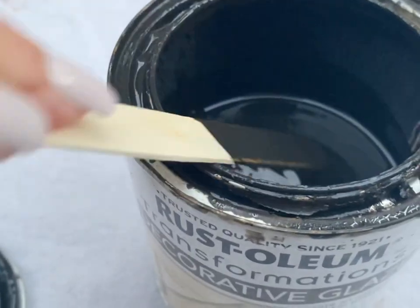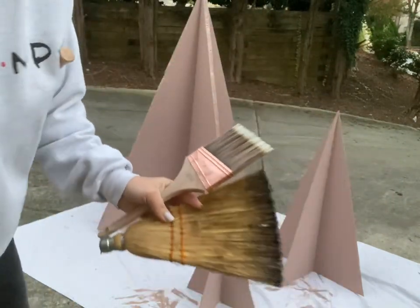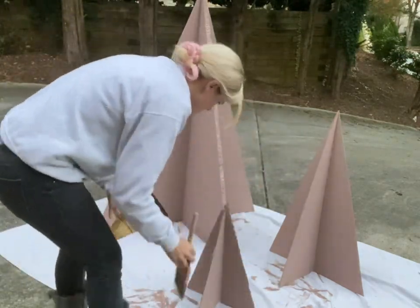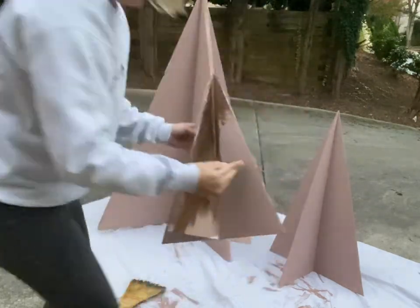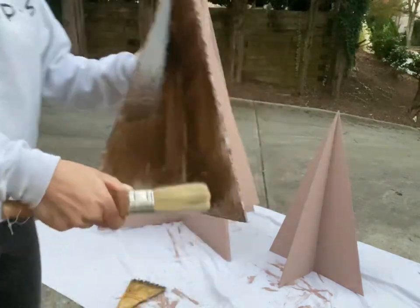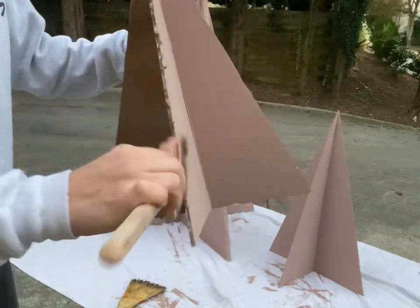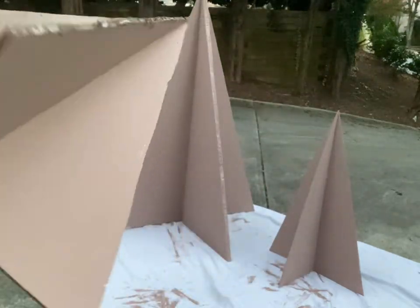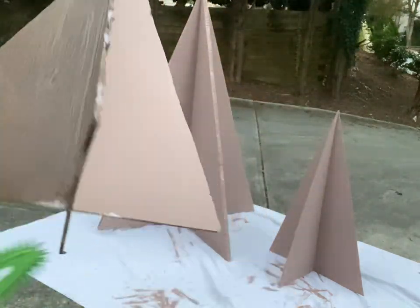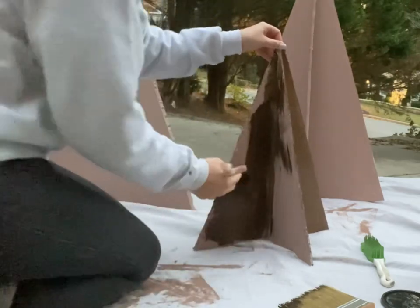These are my go-to utensils: I have this little dog brush, my whisk broom, and a deck staining brush, which I feel is absolutely necessary. All you need is a big fluffy brush to smooth the gel stain or the glaze — this is a water-based glaze — so it's not too harsh. You want a really even thin coat of glaze, and then you can go over it with your broom. The dog grooming brush actually worked best here because of the outdoor paint absorbing. I've heard people use the dollar store broom too and it works great. I'm just putting the glaze on with a regular paintbrush and then the deck staining brush — those are about ten dollars at Lowe's or Home Depot.